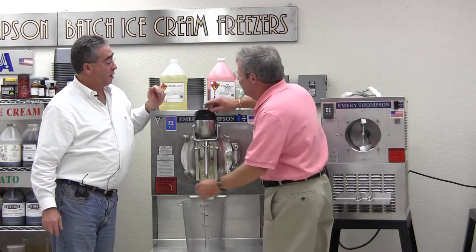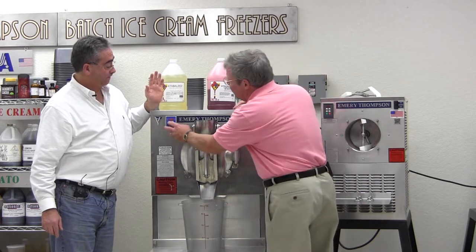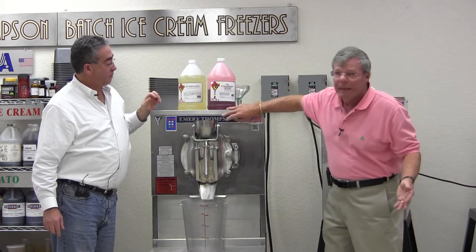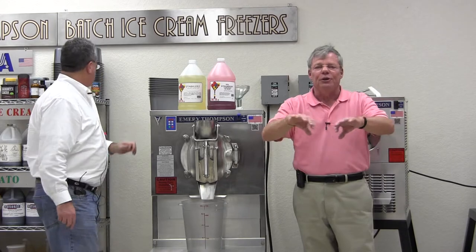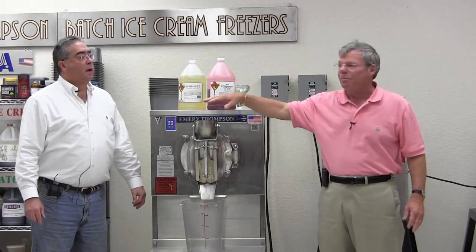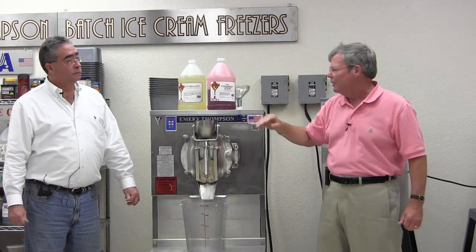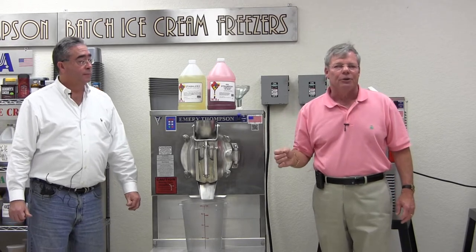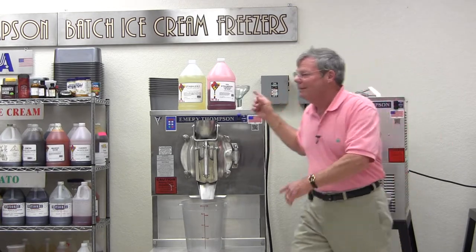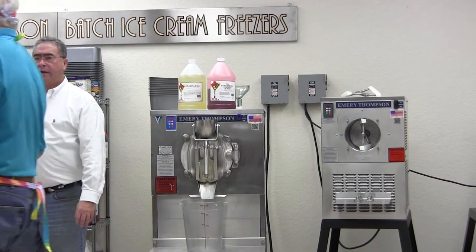Are you ready to start it up? Yes, we are. Okay, so we're going to start up the infinite overrun. We were running at 170 RPMs — we're going to take it up to full speed because air is really not a factor in sugar water. Water is going to expand 17%; if you take this liquid and put it into ice cube trays, it will expand by 17%, no more. So we run at full speed. The faster you spin it, the faster it freezes. This product with high sugar content takes a little longer. Now, there are three levels of Italian ice and I use all three — I think you'll use all three in your business. There is using fresh fruit. Oh, I've got fresh fruit! Hold on a second. Jeff, do we have citric acid in here?